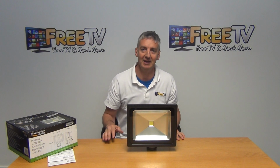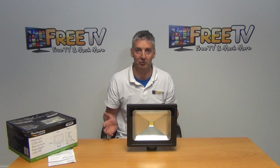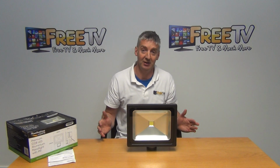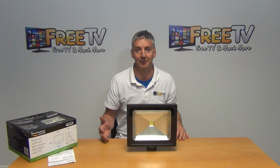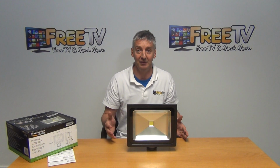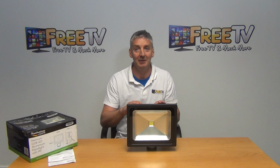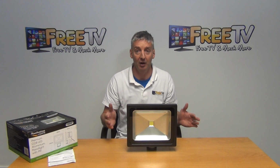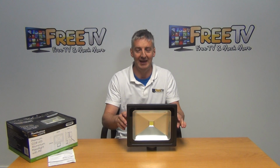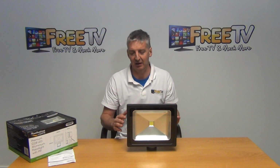So some of the key specifications on it: it's IP65, which means it's suitable for indoor and outdoor use. What attracts people to LED obviously is the huge energy savings, but the fact that it comes with a 40,000 hour warranty on the LED itself means that it's going to be incredibly low maintenance. Indeed, Manhattan are giving a full 5-year warranty on all of the floodlights that they're selling. It comes with aluminium casting here, so once again it's minimizing the chances of any type of wear.